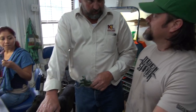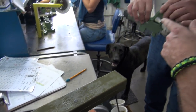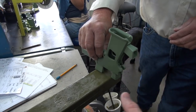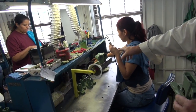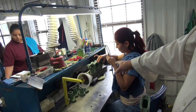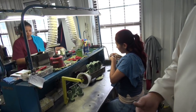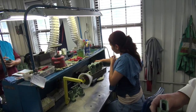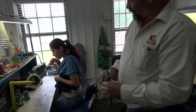After we inject them, we take this wax pattern and set it up onto what we call a tree or assembly — also called a sprue. What you're doing is attaching the wax patterns onto the tree to make one assembly. We use a hot plate to melt the gate, a little stick-tight glue to attach it to the tree, and then a jeweler's torch generated by hydrogen to wax-weld everything together so it's one flawless seam assembly.